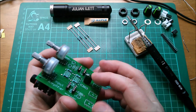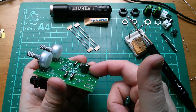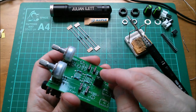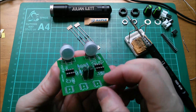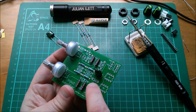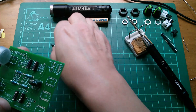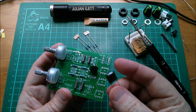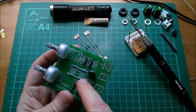Oh, that's pretty good — yeah, that's a loose fit in there, which means it's a good fit because it's sitting right down on the board. This one should be the same if the capacitors came from the same manufacturer. Oh, that fits very well. Now, in fact my footprint is not very indicative of the fatness of these capacitors, but I suppose I could fatten up or widen the silkscreen outline a little bit to more accurately represent these.